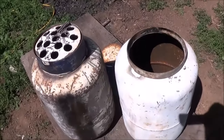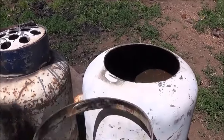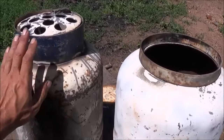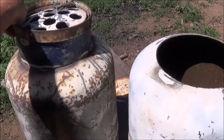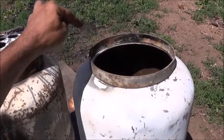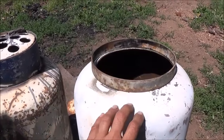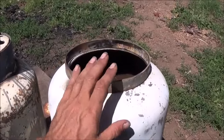At this moment I'm beginning to work on the lower ash chamber right here. To get the hole I've cut in there, I used the ring from the other tank — the same ring I used to get the diameter for the reduction zone. This ring slides over our reduction zone nicely, and I used that to set it down, got my center marked, and cut that hole in there. Now I'm going to weld this ring to this tank, which will allow me to turn it upside down and slide it down inside the ring.